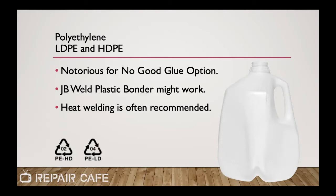There was a question about how to loosen any of these bonds after you've used one of these products. You can look up the material safety data sheet for any of these products and there will be a suggestion of different solvents you could use. If you take a look at the JB Weld website, for each product there is an SDS or specifications page, and there will be a list of solvents that can separate them. Probably the one most commonly available in a hardware store is toluene — that's a very strong organic solvent that may work in separating something you have glued together.